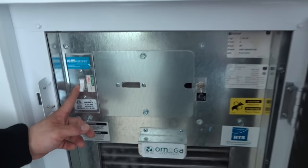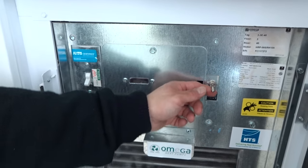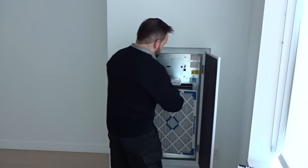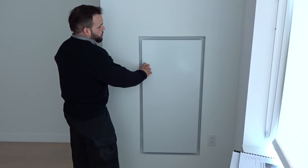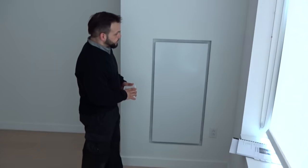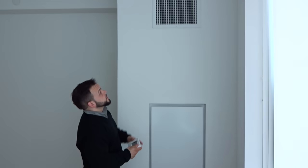To the top left you will see your on button — the main switch or the reset switch. And to your right you will have the blower speed on low and high; we will pretty much leave it at the highest setting. It is very important to always keep your filter clean to prevent any particles from reaching your coils. It is also very important to keep this return air grid or return line free from any items or objects, especially beds, sofas, or tables. And to your top you will see your air distribution for heating and cooling.